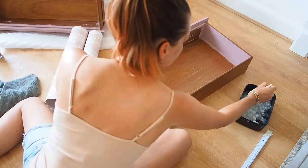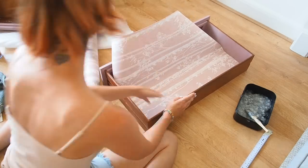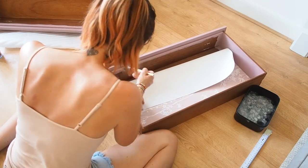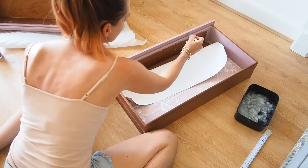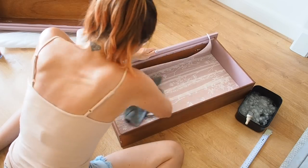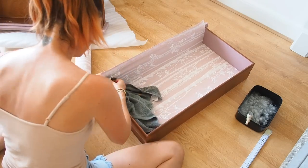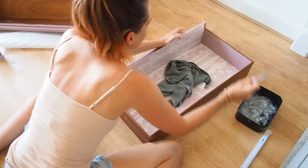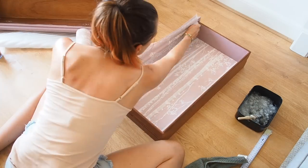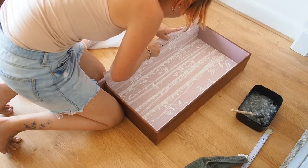Now I'm going to wallpaper the inside of my drawers. I've got paste-the-wall type paste mixed up and the wallpaper is left over from my previous house — a gorgeous thick pink wallpaper with a tree design, perfect for a job like this. It will line the drawers and make the inside really hard wearing. I've already cut the pieces to size and I'm going to paste all inside the drawer, lay them in so they run along the bottom and up onto the fascia of the drawer. I did paper my handles in which prevents access to the thread and bolts, but this unit isn't in daily use. If you use it every day you might want to cut yourself a little hole in the wallpaper to allow access to the drawer bolts. Then I cut the little bit of excess wallpaper off with my knife so it's nice and neat.